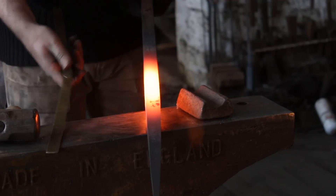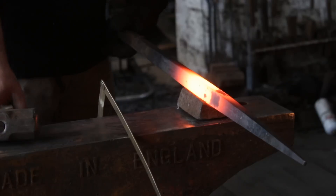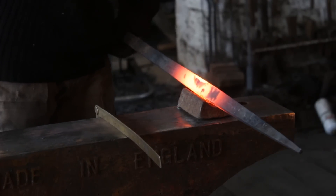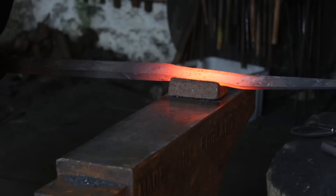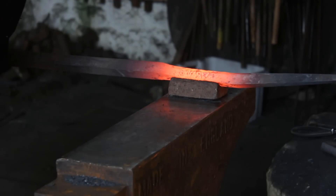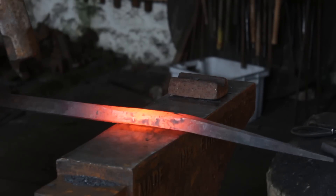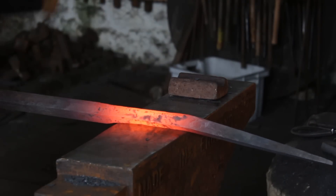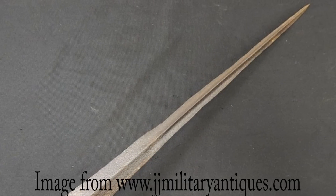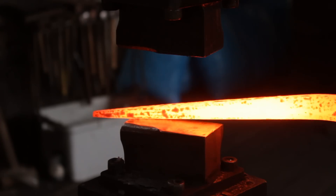Up to fourteen inches, and using an inch round swage, I will start flattening out the bottom and rounding off the top of the blade. I'll just help that along by going onto the flat of the anvil, just knocking off any corners. There is a double fuller going down the blade so at this stage I will start roughing that out.